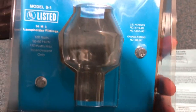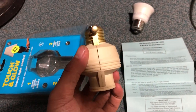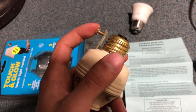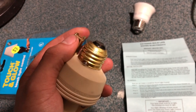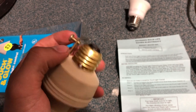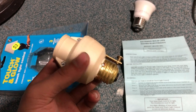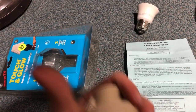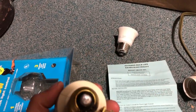It says a patent on it. It's pretty simple really — you screw this into a lamp, then you put the bulb in here, and it has this little tongue thing. It senses the capacitance on this little tongue and it switches the lamp using a triac. This worked when I first got it — there's a lamp upstairs I tried this in. It worked, even sort of worked with LEDs. But then I remembered I have this.